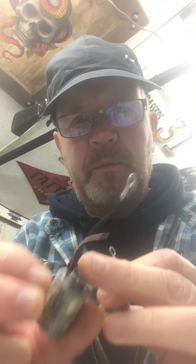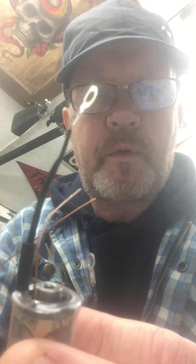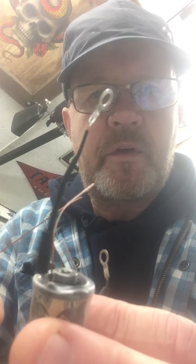I can't really remember. So anyway, when you're finishing off the coils, the last thing is you've got to put some heat shrink on and wire on what they call the solder tabs. That's the wire as it comes. Hopefully you can see that properly. Now it has an enamel coating on this wire, and as you can see there, I've scraped the enamel coating off the end of the coil.